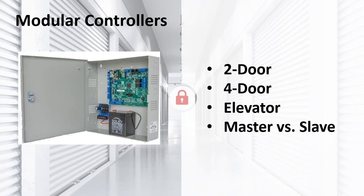The elevator controller will control one elevator bank — either a single or double elevator. This allows you to control access to only the floor that the customer has a unit on. All elevators will automatically return to the ground floor, where a code will be required to go to the assigned level. You can also use this controller to trigger a door strike on a nearby door. All systems require one master controller; all additional controllers are slaves. The master should be specified as a USB or LAN connection — USB if the computer is on-site, LAN if connecting through the internet via port forwarding.